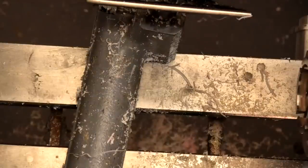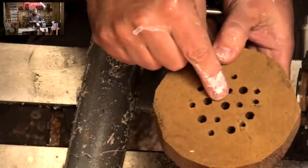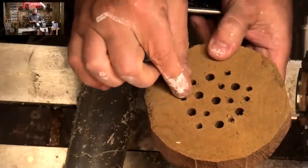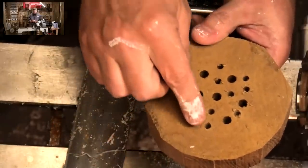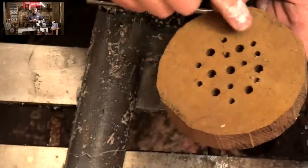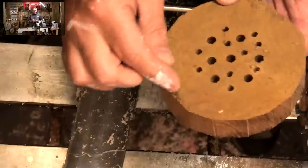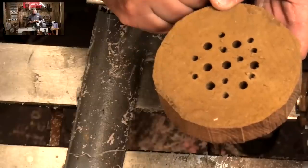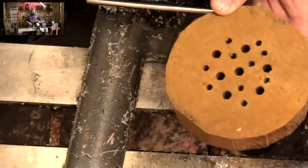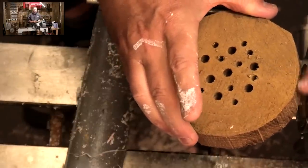Just a couple of pitfalls — I've made a few of these now for practice. Because I want to pre-drill this, I've done the centre hole to hold it on a screw chuck and drilled the flower stem holes. Just be aware: you have to mark where the internal part of your vase shape goes to, and put all of your holes within that diameter. Otherwise you'll cut off some of your holes with the vessel itself, or worst case, the flowers just drop into nothing. Mark that diameter of the internal surface of your vase. The lid needs to sit over fairly snug so it doesn't wiggle, and fairly deep so it's nice and stable.